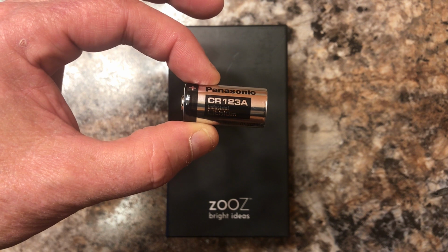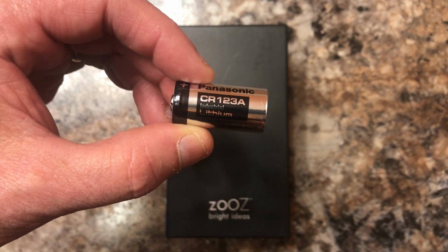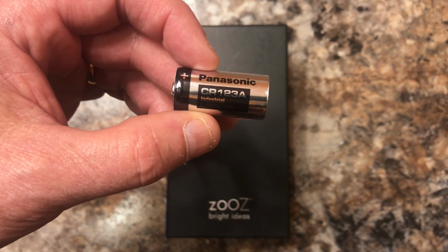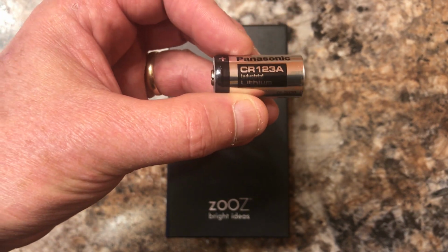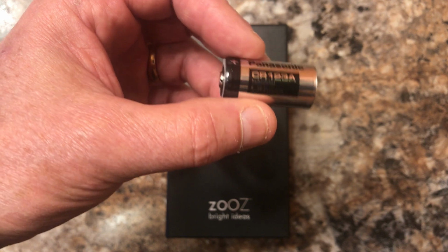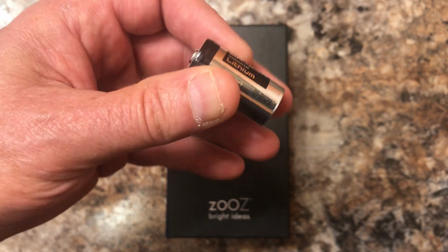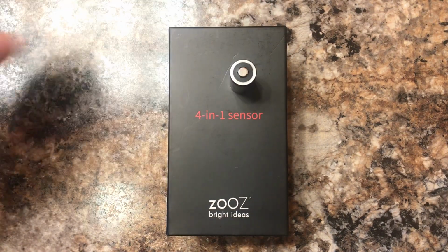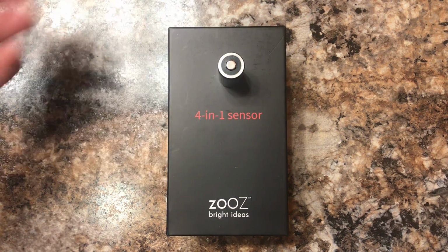One additional piece of information that I want to pass on. If you look at the SmartThings forums, you're going to see a lot of banter on there about the terrible battery life on this sensor. This latest sensor has been updated with a larger battery. It's now using this CR123A battery, and I guess the battery life is much improved. The battery life on the former model was so terrible that a lot of the SmartThings community members actually decided to direct wire this thing because it was killing batteries within weeks. So I think this was a nice improvement in the current model.